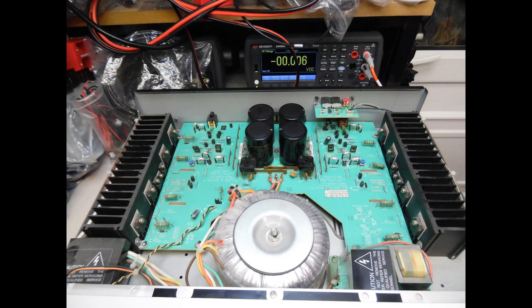Towards the rear you can see the large smoothing capacitors branded as Rotel, and you can see brown glue around each one. We know from many tutorials that this brown glue needs to be removed because it goes conductive and also corrosive. The task was to remove the back panel, then remove the four fixing screws for the heatsink and the center fixing screw that goes through to the ground point, which sits center to the large electrolytic capacitors.